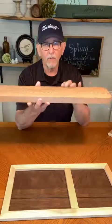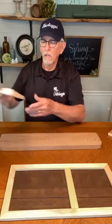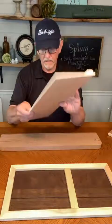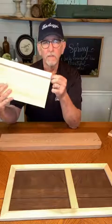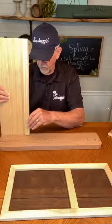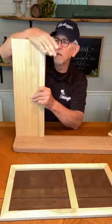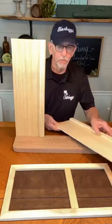That groove goes to the back and goes up. Then you're going to get two walls. The walls are going to be marked on the back whether they're right side or left side. At the bottom there's a little bit of a space — that part of the wall is going to go right in that groove. It aligns to the far edge. Just align it with the very edge of this wood right here and give it a little bump.